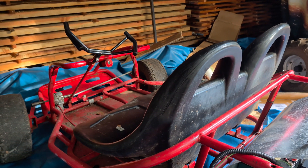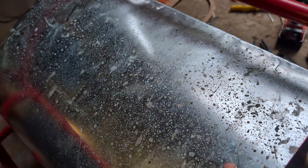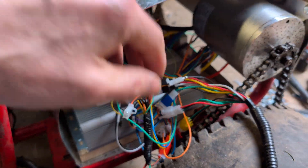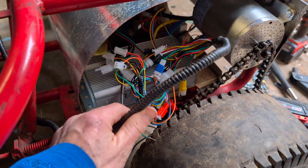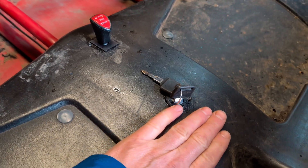So we can take this one around the neighborhood. Here's where we are with the go-kart conversion — welded on a plate for the accelerator, ran the wire underneath and out the other side. I have a piece of metal I bent over and attached to the plate holding the motor. The batteries and electronics are all hosted here. I've attached a charging outlet on the outside, riveted it on. The only other penetration through will be this jacketed wire harness running to the forward/reverse selector and the starter.